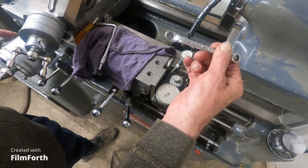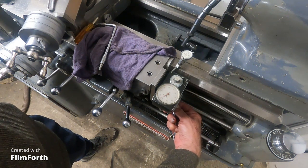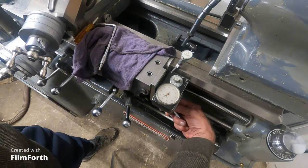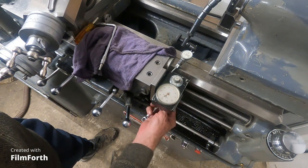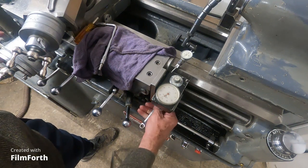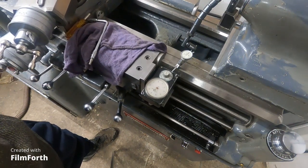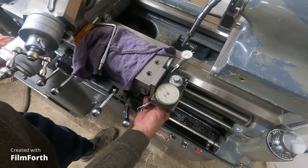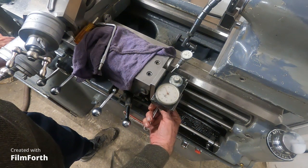This one's off, so I'll get a wrench under there. I'm going to back this one up a little bit — see if we can get that going the right way. Going to loosen it, tighten it, and see if it works. Getting close — about half a thousandth into that five. Let's see if we can snug it up and get it close.